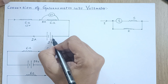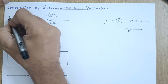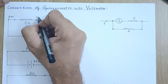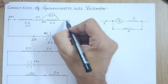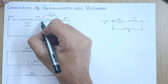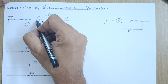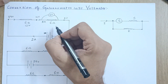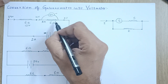In short, if one end is 0 volts and the other end is 24 volts, then at the midpoint you have a potential of 24 volts dropping by 12 volts, giving 12 volts. Then another drop of 12 volts brings it to 0 volts. So the potential drop across the 6-ohm resistor, measured by the voltmeter, is the difference between the two voltage points — the correct answer is 12 volts.